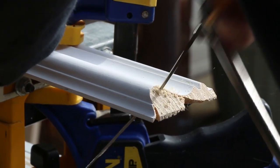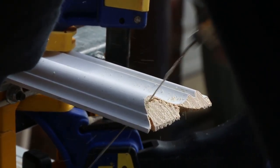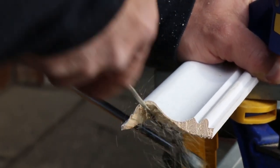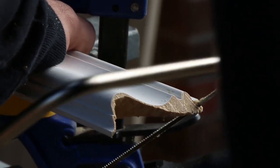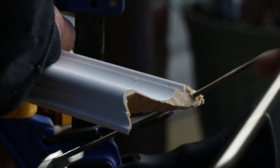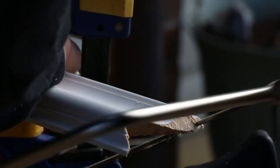As you can see, this part of the process is time consuming while making the cut, but it's these extra steps that are going to create a better finished product. You're spending a little bit more time here making your inside cope cut, but there's no question about it — once you put the molding in place, it's going to fit. Your inside corner will be appropriate and you won't have to adjust the angle of your molding to close a gap.